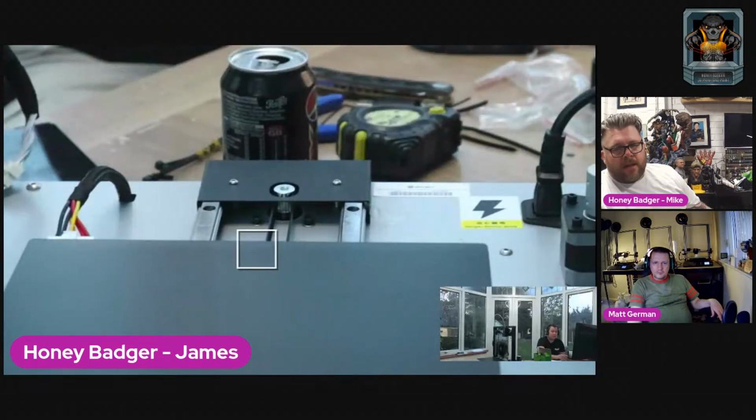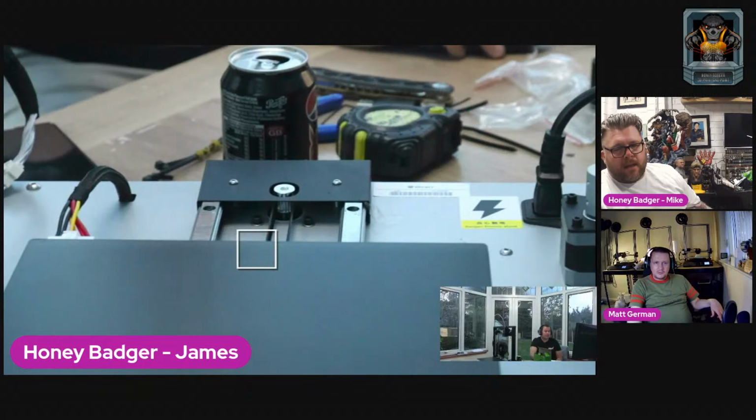Some of my Ender profiles will work exactly the same on it. So what I'll probably do is wait to test the power loss recovery, see what it does. And then once I've tried that, I'll try putting on a calibration cube on Cura with a modified Sidewinder profile, and we'll see how that comes out. We'll do it at 80 millimeters a second. In fact, I'll tell you what, we'll do it at 100 on Cura. Yeah. Just to make it fair. So the print speed is going to be 100 millimeters a second.